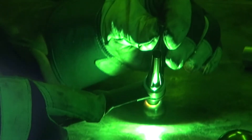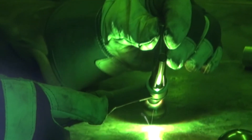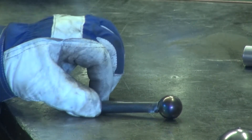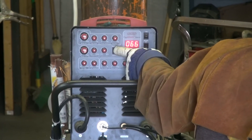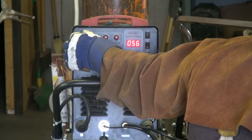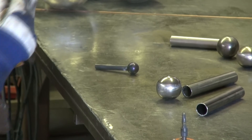Nope, need a little more juice. Okay, so I got just a little tack weld on there with the TIG. And now I can come back with my rod and just go ahead and lay a bead around there. So what did you end up setting it to? I went to no pulse — I turned the pulse all the way off and I went to about 58 amps.